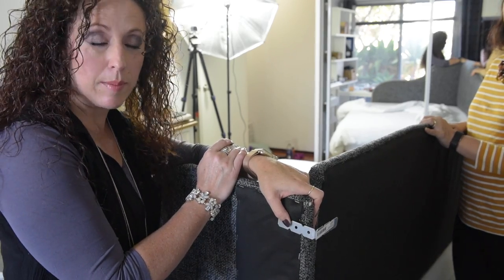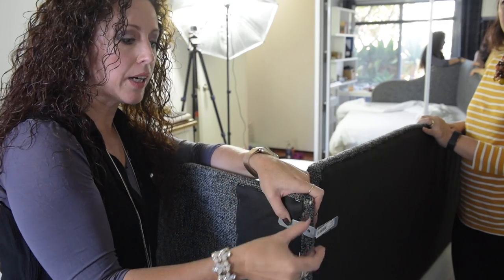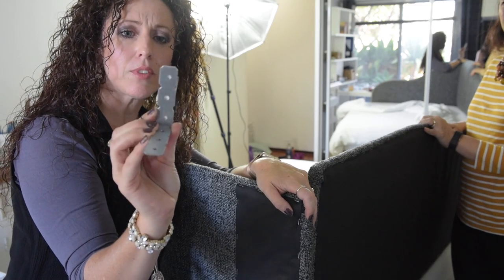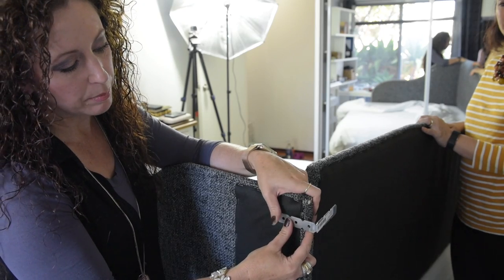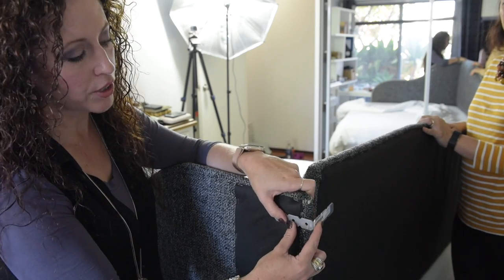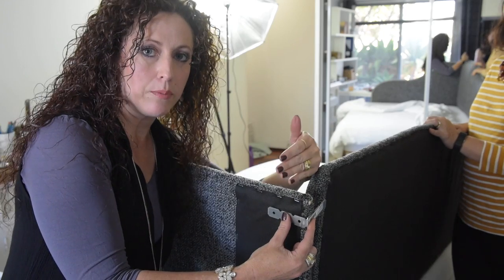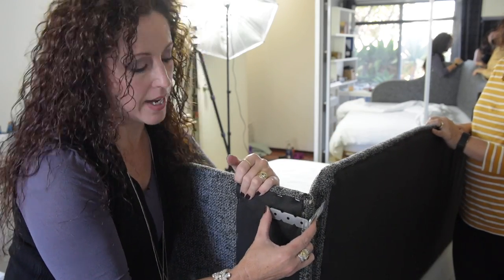So this is the day bed. We're going to make the corner now and join them up. What I normally use is just an ordinary L-bracket — you can find them in any hardware store — and put them on the side. You'll notice that I move it over just a smidge; you don't go right in the corner, because you've got to allow for the foam and the other board to come in. Because the board's already 9mm thick, plus your foam, you'll have to compensate for that.